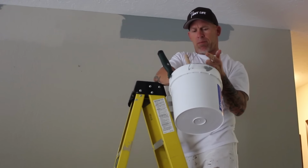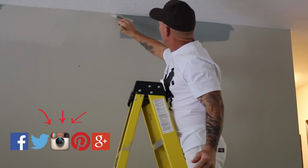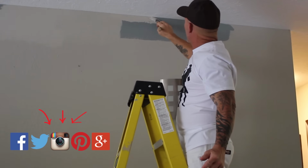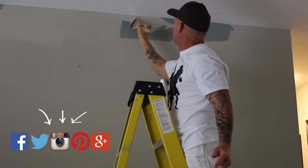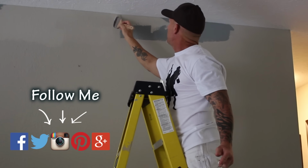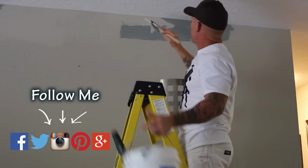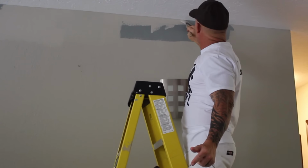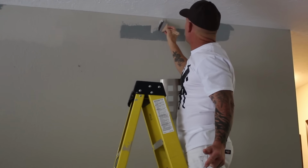So once again, I'm gonna load up my brush, pat it on the side, gonna bring my brush up to my cut-in. I'm gonna work about a foot section, go back, work the opposite direction. Then I'm gonna load up my brush, pat it on the side, bring it up to the ceiling, cut it one direction. I'm gonna cut it back the opposite direction.